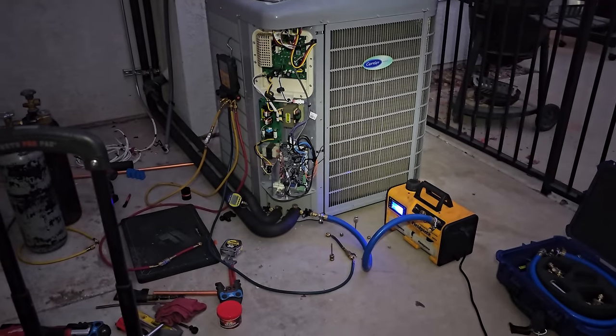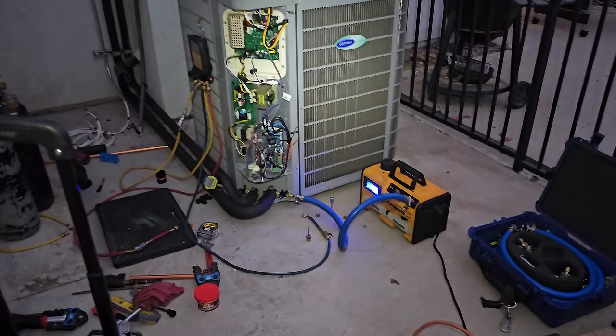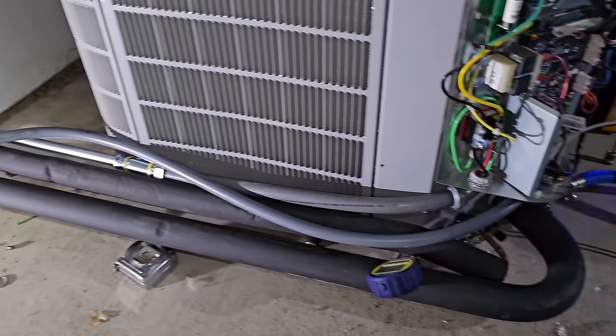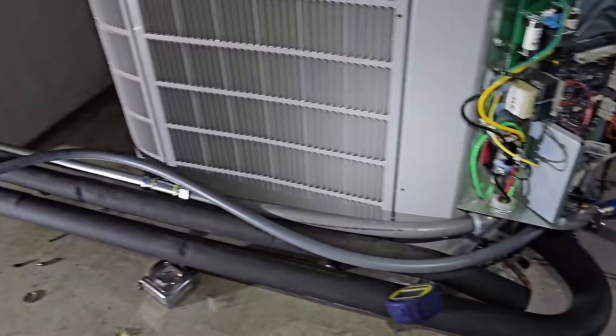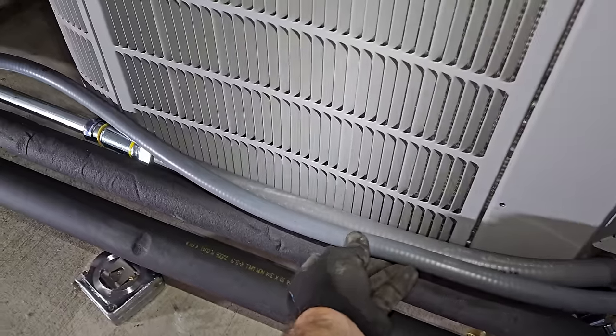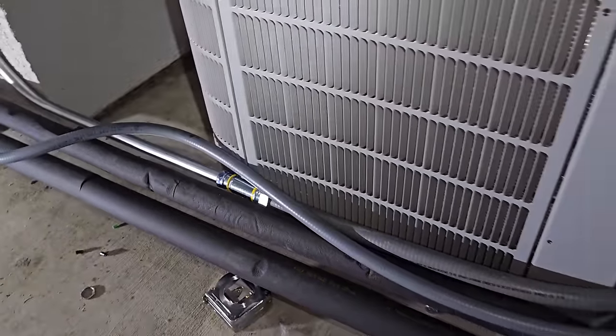We're doing a one hose pull right now, so give it some time, and I'm gonna start doing the electrical now. Pull the vacuum, it all went good. I'm just finalizing the thermostat wire. I've got to dress this up. I'll strap the conduits together and make them look pretty later.